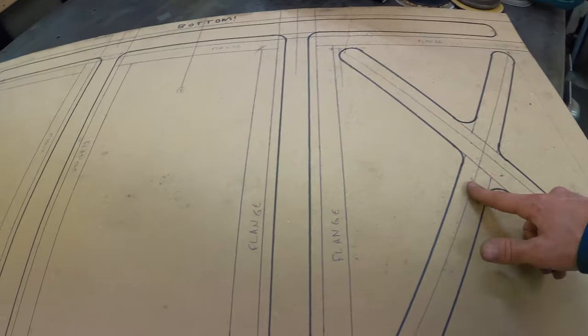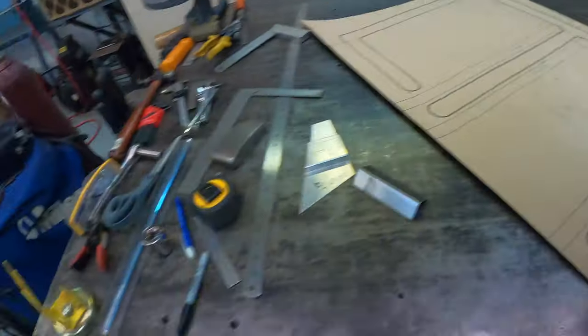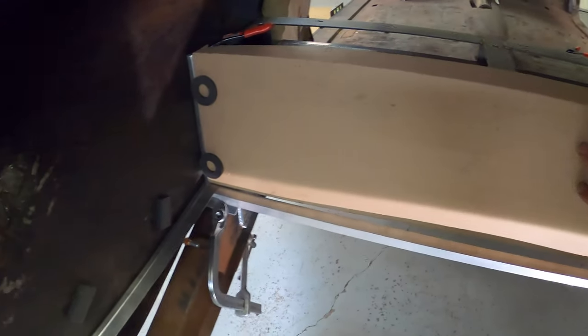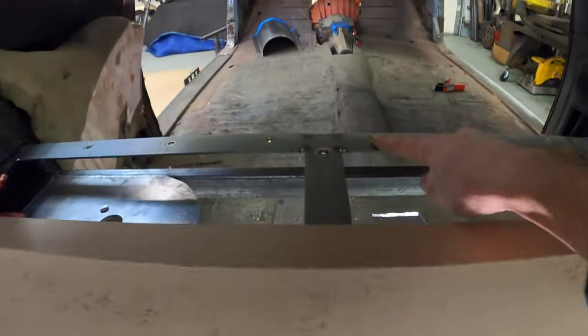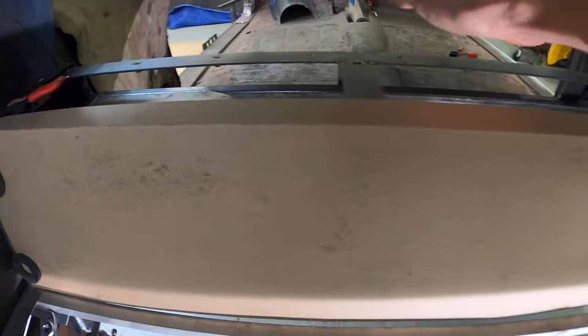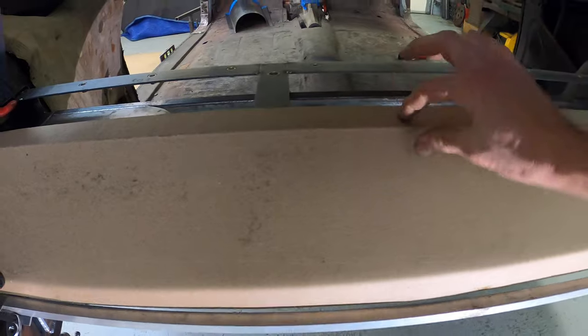And then what we can do too is keep this general design theme and put that onto the back panel here. So I went ahead and I made this back panel. It's gonna have the bend in it up top here, and you can see where the nutserts are. So there'll be a piece of 1/8 inch rubber underneath here, and there'll be another sheet that kind of caps it, that's removable. And those three items will be bolted through all of these nutserts and be nice and secure and also be sealed from the elements.